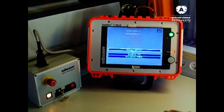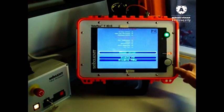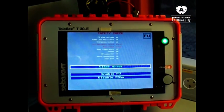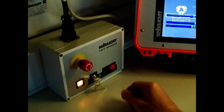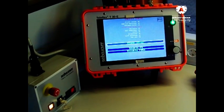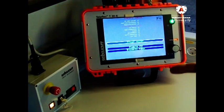In the beginning it is possible that we get some error messages here, so I try to clear the messages. We still have a message here: emergency switch / key switch error. That means it is possible that this key is not connected - this one is not okay. So let's try again. The emergency switch means we have an additional switch in the rear of the car outside, so we have to go outside.